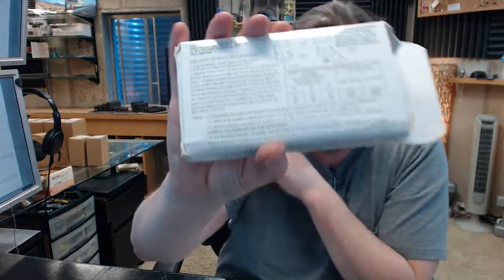Now, there's a certifications and hinge selection guide link that's below this video along with the installation instructions. Let's do the certifications first. And again, that's on the back of your box. It's that table that's there. But here's what we're faced with. If it's a 4x4 hinge, you are most certainly using this on an 1 3/4 door. If your door is 85 pounds, they're talking about 2 spring hinges and then 1 regular butt hinge. If you've got a door that's up to 110 pounds, they want all 3 spring hinges.